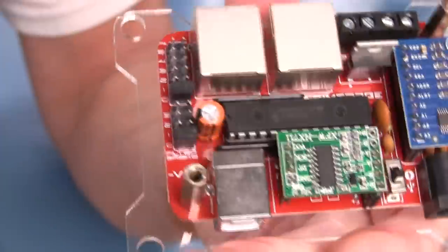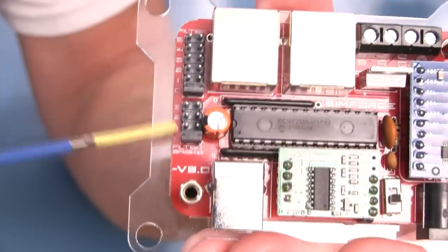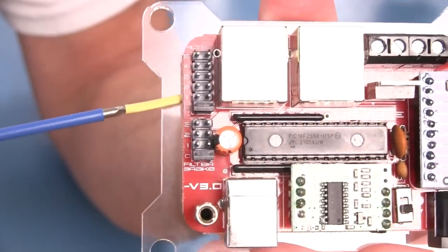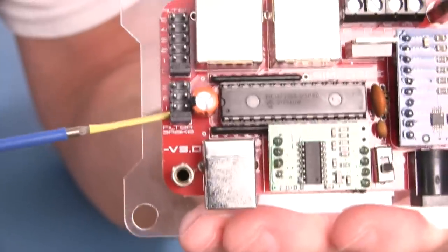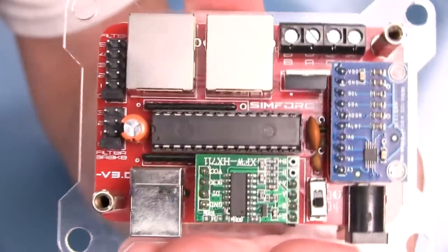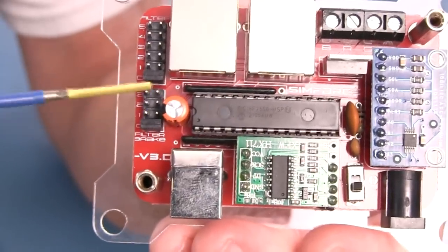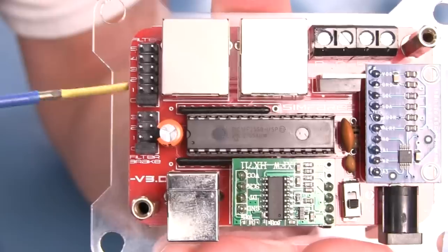So we're changing the jumpers instead of using a piece of software, which you could probably do too; we're just using physical jumpers here. If I have noise on my brake pedal, we're going to check this out. I'm going to pull DI View up. Even though I don't have a bunch of motors running around it, usually there's some kind of movement there. So we can change these jumpers on the filters and see what effect that has.